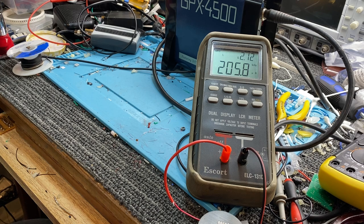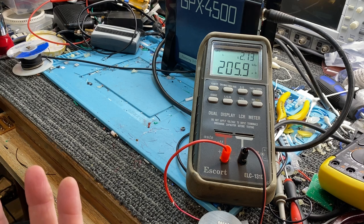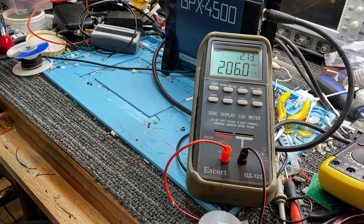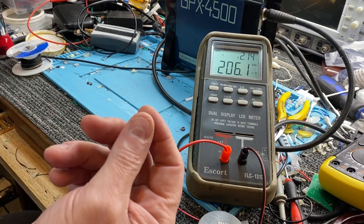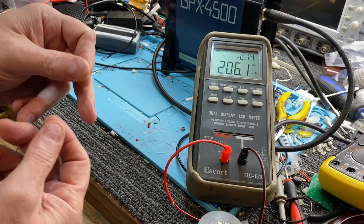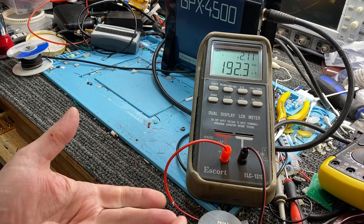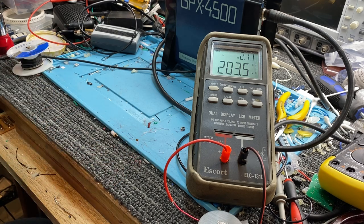The more winds you get in there — or partial windings — the more capture of the signal you're going to get in receive mode. Sometimes the difference between 280 and 300 might be three-quarters of a winding. And just to make things so the start and the stop end up on the same place in the coil — this is how these are made. Some coils are actually diameter specific, so when you wind the coil, the start and end winding come around and meet, and it'll be 300 microhenries plus or minus a few.